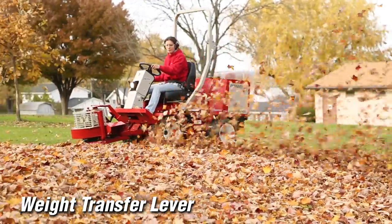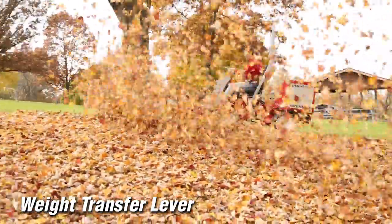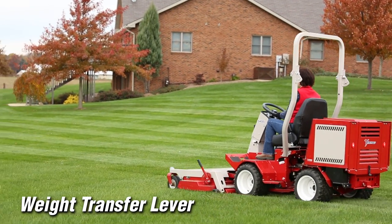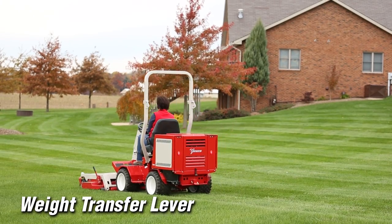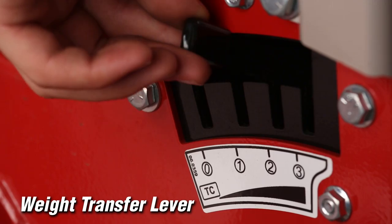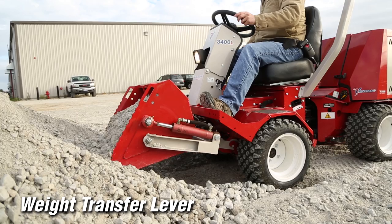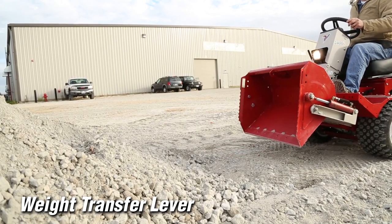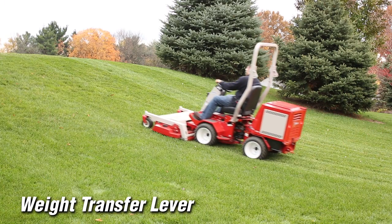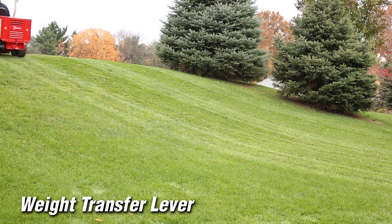Selecting the proper amount of weight to transfer depends on the attachment being used, ground conditions, and operator preference. A lightweight attachment such as the LA-162 power blower will stay up when in float position with full weight transfer on. With full weight transfer on and mowing in the float position, the mower may not go down quickly enough when cresting a hill or mowing uneven lawn — weight transfer must be reduced or speed must be lowered. Using full weight transfer with the slip scoop will allow the tractor to lift more weight; however, down pressure must then be used to lower the scoop when empty. The biggest value of the weight transfer system is best realized when mowing on slopes, where traction, stability, and performance are increased.